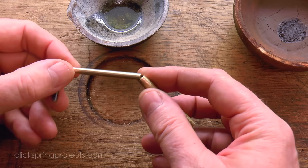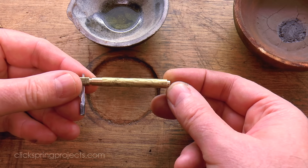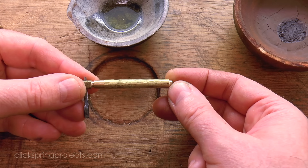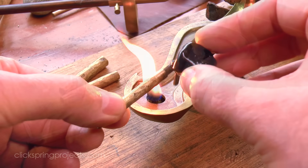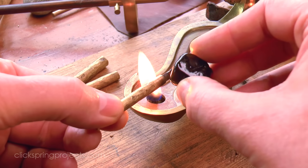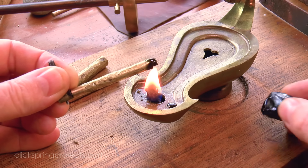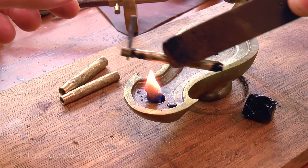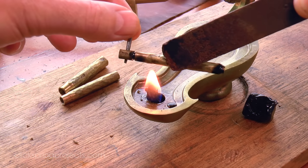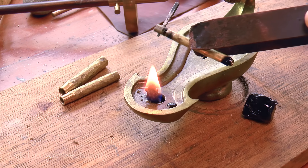This represents the more demanding end of the range of fits that can reasonably be claimed to have existed within the Antikythera mechanism, leaving only the question of how a set of concentric tubes might have been formed. No doubt there are a few ways this could have been done, but concentric tubes are naturally suited to a common axis of formation. So if they did indeed exist, perhaps the process went something like this, with the first step being to true up the outside surface of the first tube with its internal bore.